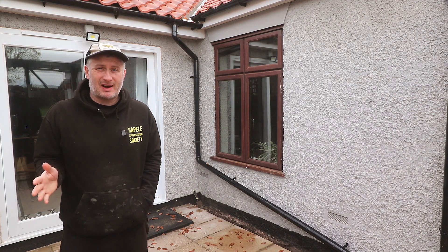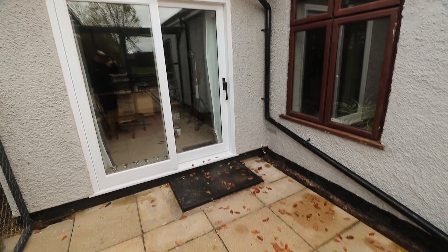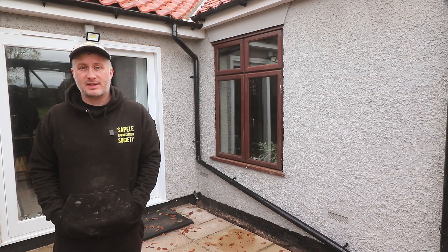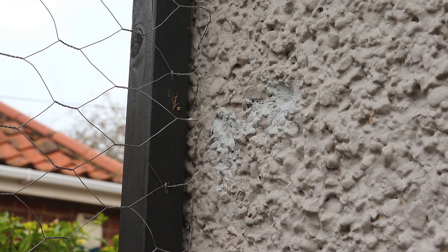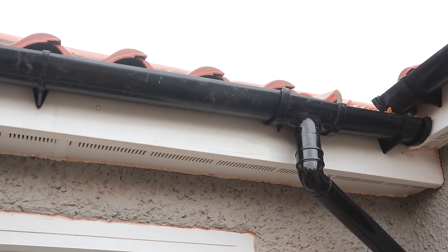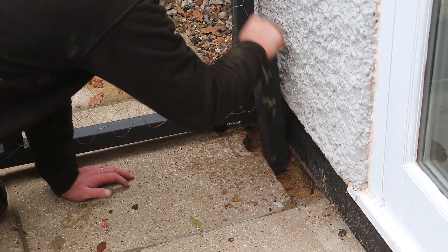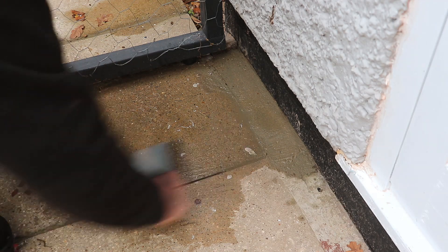Skipping ahead quite a bit because it was raining and I was miserable, but as you'll see the new downpipe is fitted. The gutter has been tilted so that water drains into it, and I tested it with a watering can — the water seems to be running to it just fine. The real test is keeping an eye on where the new pipe meets the old in the ground during a really heavy downpour, so I'm leaving it exposed for now. I waited for some heavy rainfall and went out to have a look, and I'm pleased to say it all seems to be draining away just fine. As a temporary solution it should do the job for now, but we don't want to leave it like that forever because the pipe looks awful. I also still need to add a couple more gutter clips. Finally I filled the old void with some leftover building sand and then a four-to-one mix of mortar. Please do let me know in the comments what you would have done differently, and thank you for watching.